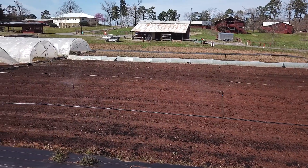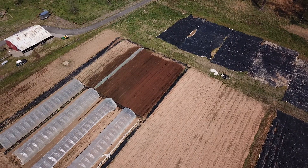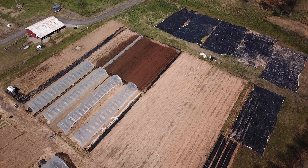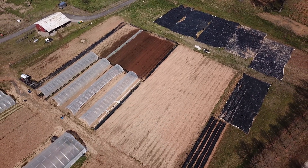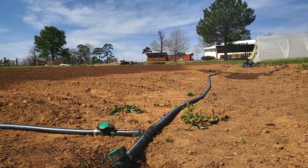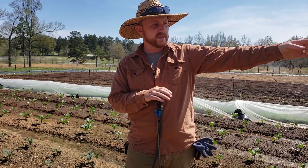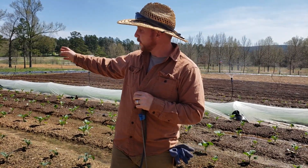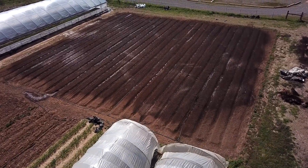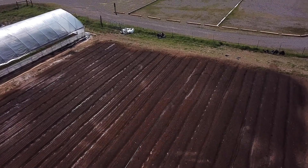The way we have our system laid out, we've designed our farm to have standardized 90-foot long beds, 24 beds in a block, which is about a quarter acre. Since these heads throw water 25 feet in every direction, for every six beds we put a sub line that has four sprinklers. Each sprinkler can reach twice the distance of the end of the bed and 25 feet to the next sprinkler, giving us great coverage corner to corner. So in this quarter-acre block we have 16 heads.